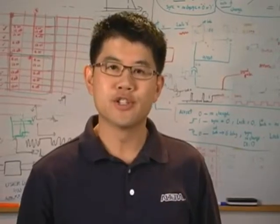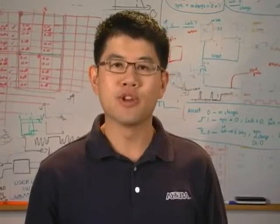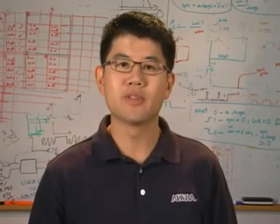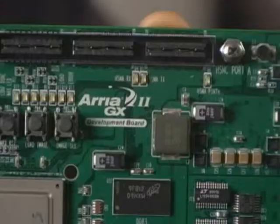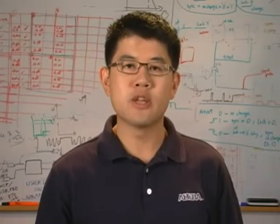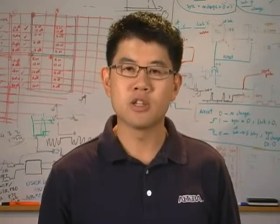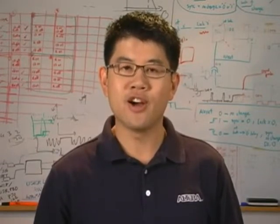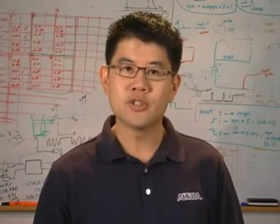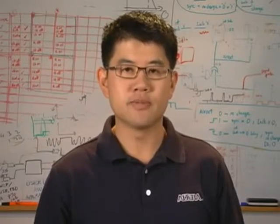If you're like most engineers, you're constantly faced with the difficult task of providing more functionality and keeping up with new standards while managing costs and power. In this video, we'll present Altera's Arria 2GX FPGAs, which are shipping now. These FPGAs provide high-end capabilities at low cost and low power, as well as 3.75 gigabit per second transceivers capable of implementing the latest protocol standards needed to quickly transfer data on and off chip. We'll introduce the FPGA's key features and demonstrate the capabilities of Arria 2GX transceivers.